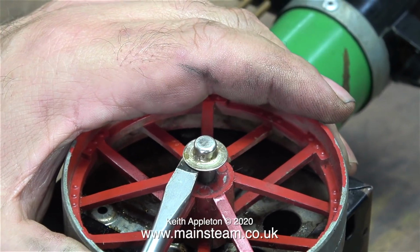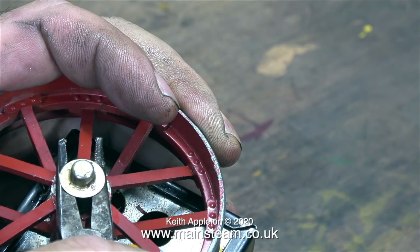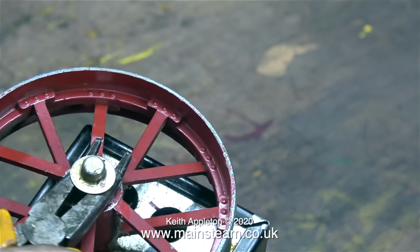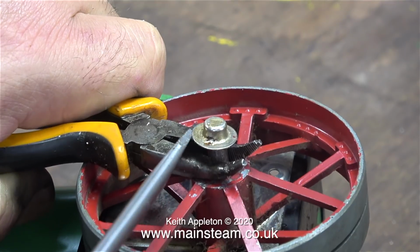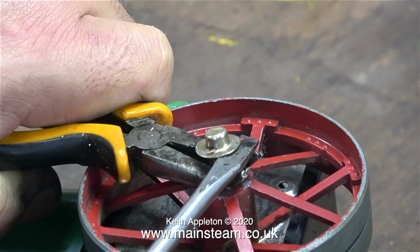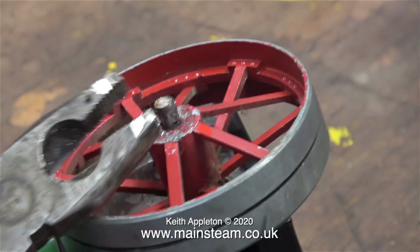Now for the tricky bit. Removing the axle cap so you can slide out the axle to get the wheel off is quite difficult to do. The best way to do it, I suppose, would be to use a small spanner. The design of these traction engines is a little bit non-mechanical in this area. The axle itself just fits through the firebox, which is made of very thin material. On a TE1A model, the firebox has some pressings on it, which locally strengthen the area that supports the axle. On the TE1, there's no such pressings, so that's even weaker.